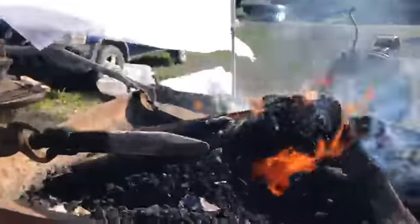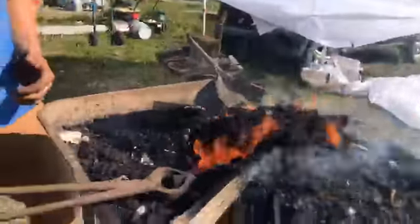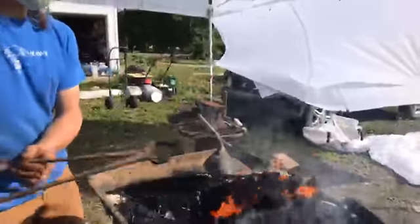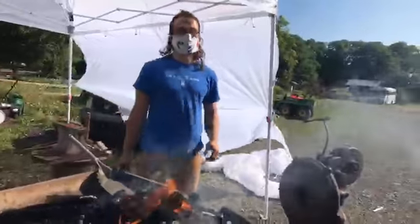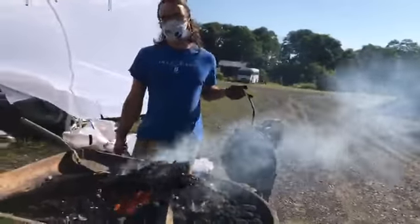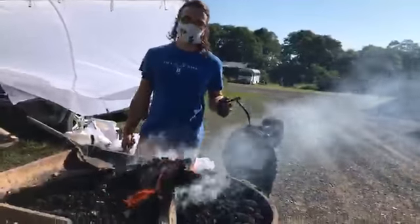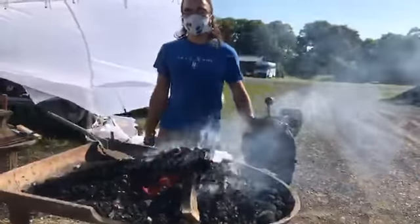And the amount of carbon affects what? The stiffer it is. The stiffer it is, but the less flexible? It's tougher. So it's harder to work with, meaning that it'll hold an edge for a longer period of time. Mm-hmm. So that's your tool steel. You want to use that stuff for everything from blades to chisel tips. Everything that needs to hold up under duress.